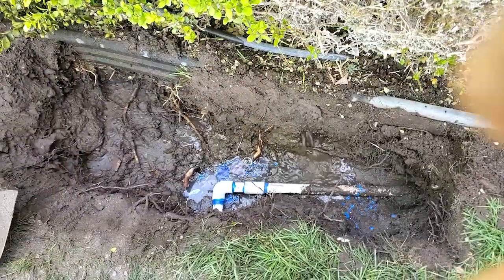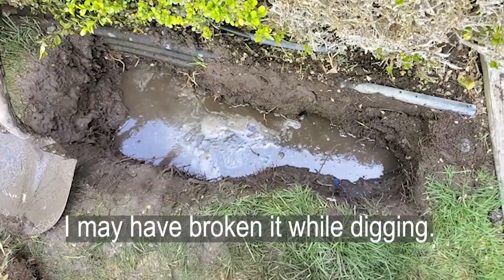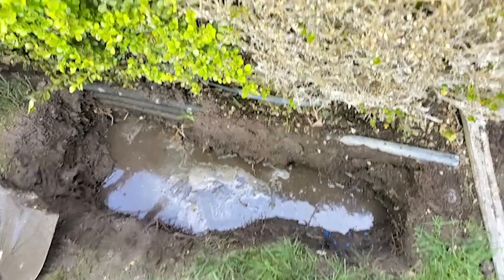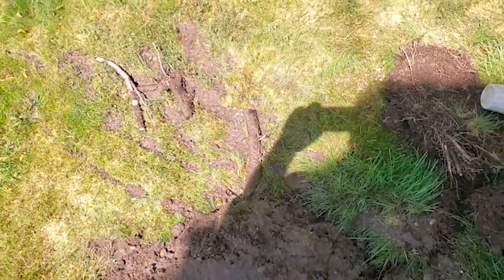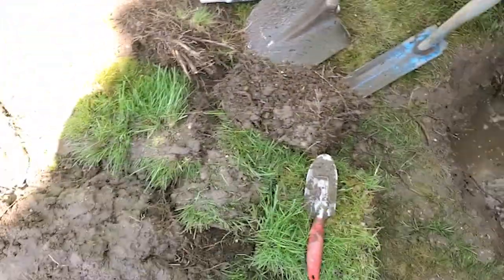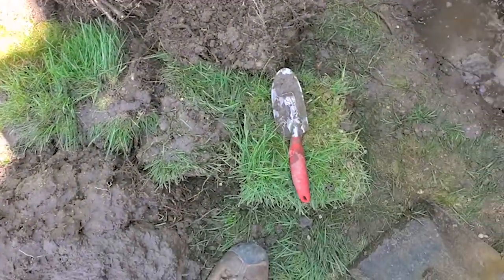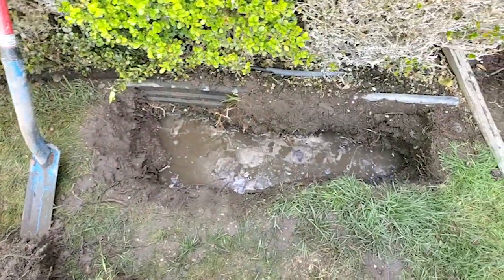Well, there's another problem. What I found — I may have broken it, and the real problem is under this hedge. That's part of the job. Pipes can feel like roots under the shovel blade and break easily if they are thin wall pipe like Class 120 or 200, like this pipe was. When I put all this back in, I like putting the rooty stuff in first. That way the soil below the sod is soft and it makes it more pliable for grading it properly.